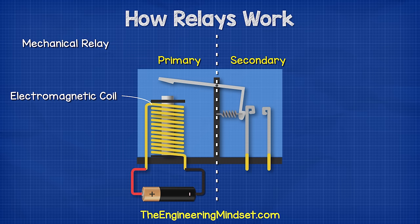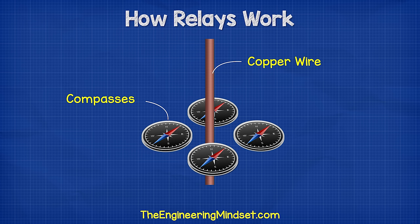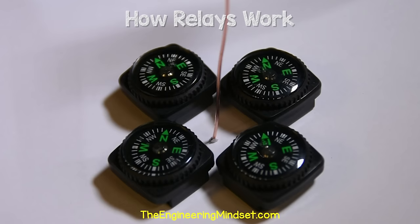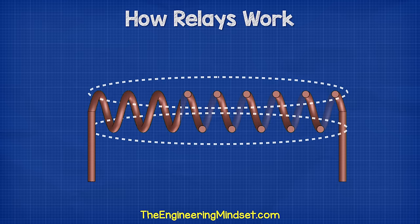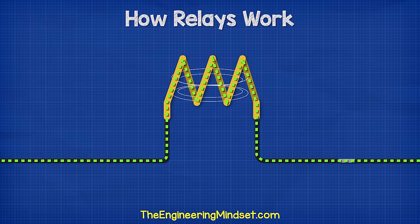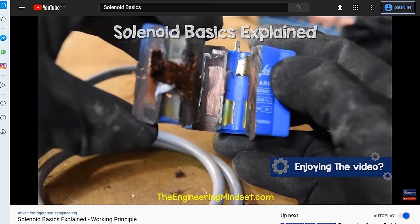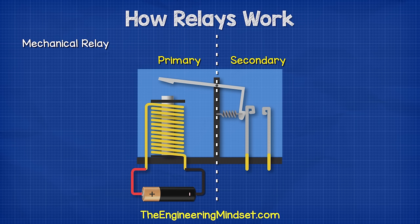On the primary side, we find an electromagnetic coil. This is the coil of wire which generates a magnetic field when current passes through it. When electricity passes through a wire, it creates an electromagnetic field. We can see that by placing compasses around the wire. When we pass a current through the wire, the compasses change direction to align with the electromagnetic field. When we wrap the wire into a coil, the magnetic field of each wire combines together to form a larger, stronger magnetic field. We can control this magnetic field by simply controlling the current. We have covered how solenoid coils work and even how to make your own solenoid in our previous videos.